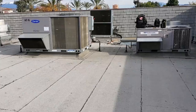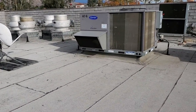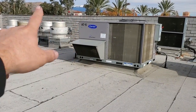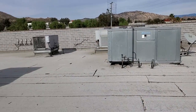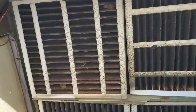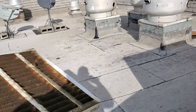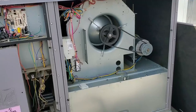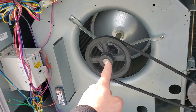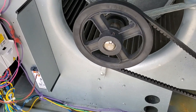I can already tell you the kitchen AC indoor blower motor is not running, and look at these filters — NorCal Dave would say 'plug-o-bug-o.' Filters are plugged. I imagine all the ACs are going to be this way. The negative air pressure is so strong that without the indoor blower motor running it's moving the blower — I first thought it was running, but it's not. The unit has no power and it's also got a loose belt.